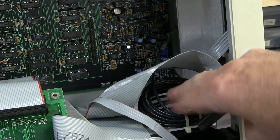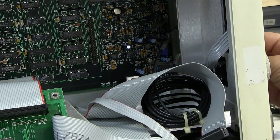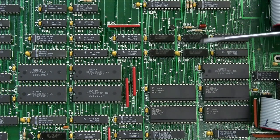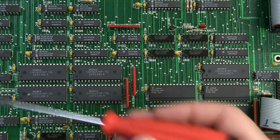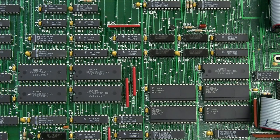I think I know what's going on here. Basically the ECL board is the one that's going to have all the fast serial input counting with the fast clocks — we'll take a look at that in a minute. It'll have all the serial data input and be doing serial-to-parallel conversion in there. Then we've just got the slower parallel data coming out, being sampled into our SRAM. In that case, 45-nanosecond SRAM is going to do the business. There's actually a little loop of coax in there — maybe a meter long — going between one of the BNCs on the front panel. That's the disc out connector, and it's just forming a delay — a coax delay line to compensate for the delay in the input counter circuit. According to the manual: these are our 45-nanosecond fast buffer RAMs, here are the buffer address counters — 74F191s — then our accumulator SRAM, and a separate copy buffer memory. So our data is serialized on the input ECL board, comes into this fast buffer, and then we've got accumulation memory and an output copy buffer.